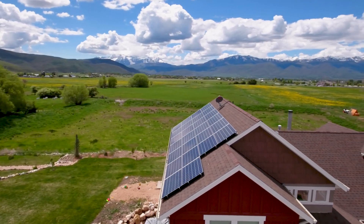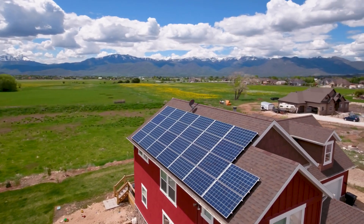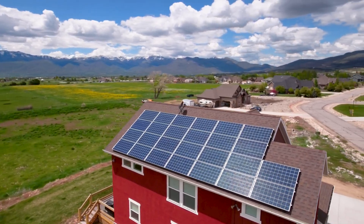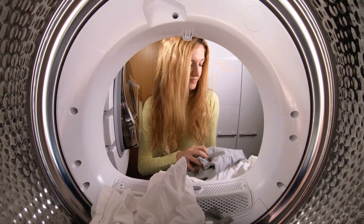Remember, you'll need enough solar panels or battery output to feed a 10 kilowatt inverter if you really want to run completely off grid or off solar. Check how much the entire battery stack can actually output, because different versions of the same product can have smaller outputs, meaning you won't be able to power much if your battery can't keep up with your inverter.